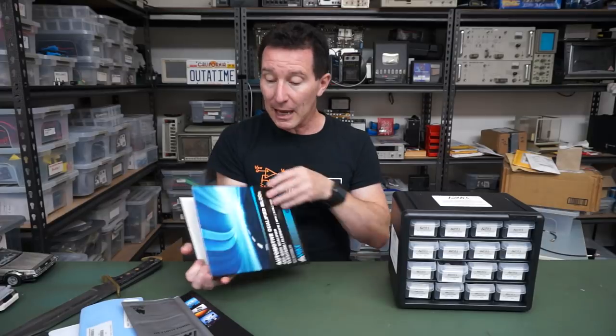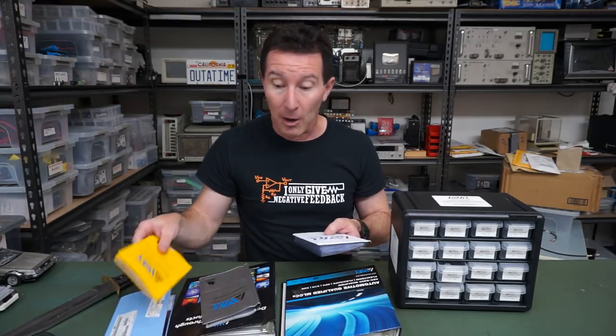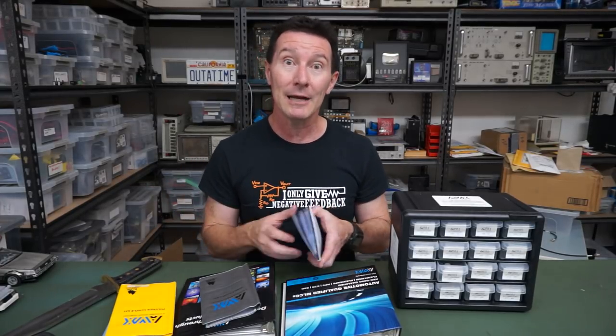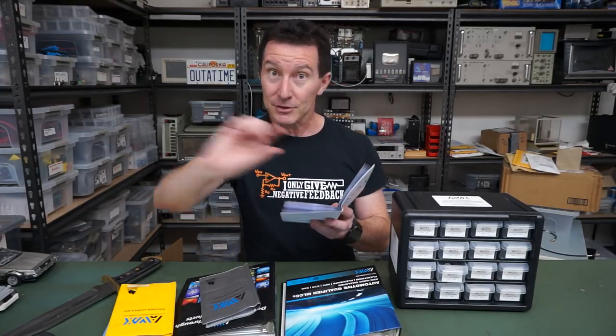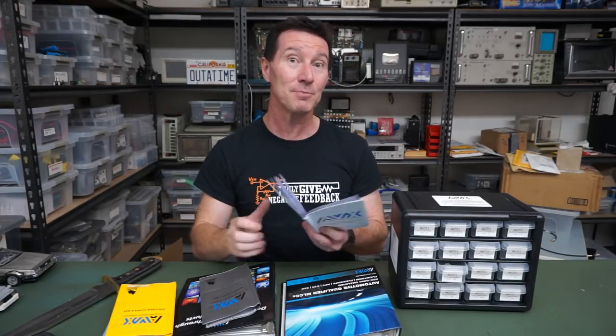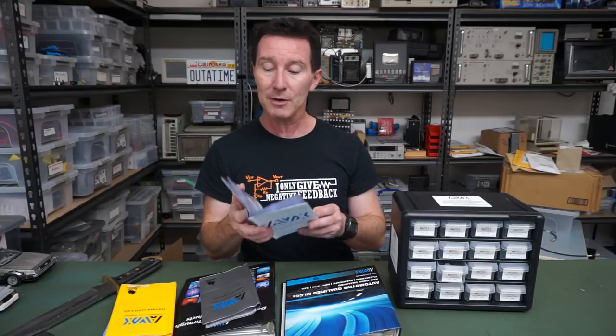It's great to have, if you're designing serious professional electronics — especially if you're in the automotive, military, or medical industries, or one of those other regulated industries — it's important to choose exactly the right capacitor, the exact right inductor, the exact right component that you need. And you will specify down to the 10-digit part number. It must be that specific capacitor, as I've done in the capacitor cracking video, and there are reasons for that.